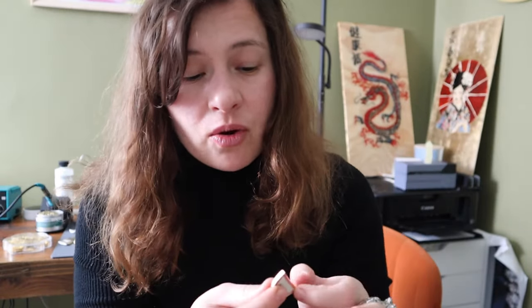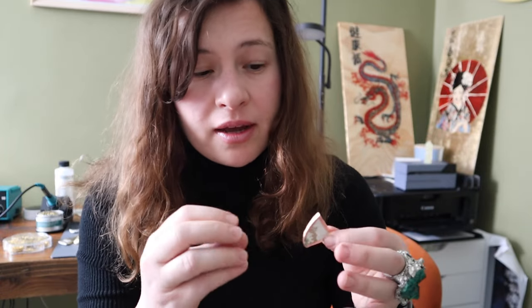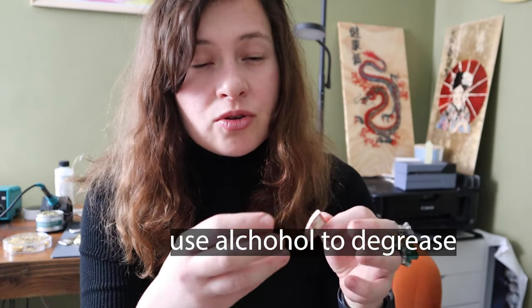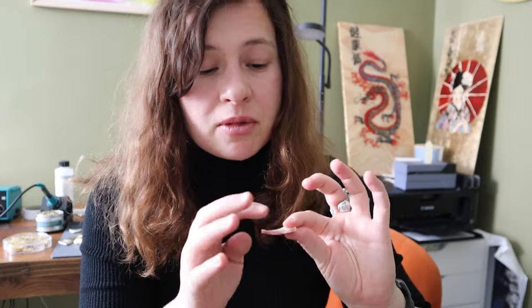Okay, I just want to reiterate something real quick. Why is it important to keep the copper tape very snug and not loose, and make sure there's no grease so it doesn't peel off? Because when you add solder onto this, your solder could completely break off. Make sure you are using something to degrease it.